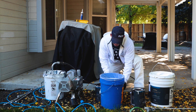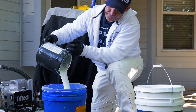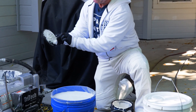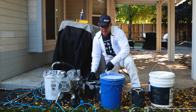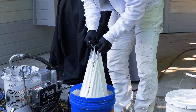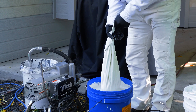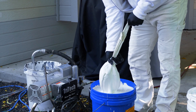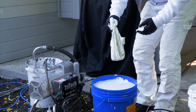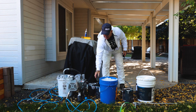I've got room to dump this one single that's partially used right here — I've already shaken these up. You can see the same thing on the top; this is the stuff that's going to fall into your paint and cause all kinds of issues. Now once you've got your bucket full, I'm just going to lift my strainer up and slowly let the paint drain out. This is why I like this type of strainer — I can just run the paint right out of it. I'm going to drop this strainer into a bucket of water because I'm going to clean and reuse it. Pull the gloves off — clean hands. Always strain your paints.